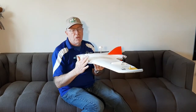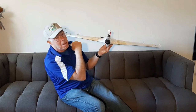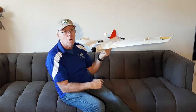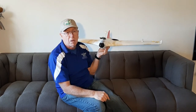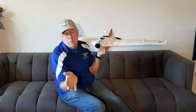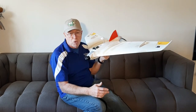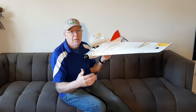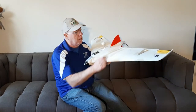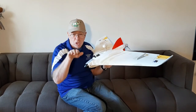It's very interesting to note that with this airplane, the mild dihedral — actually almost no dihedral at all, if not slightly negative — still causes the airplane to roll with yaw command, just like the old trainer airplanes we used to fly as kids. Those only had rudder and elevator with generous dihedral; when you used the rudder the wing would yaw and one wing would have a little more lift, and it would turn much like an aileron airplane but only with the rudder. When I flew this airplane for the first time with the drag rudders, that did happen — I did get some roll from the yaw, which was expected. You can always take it out with conventional aileron control on the elevons if you don't want the airplane to roll while yawing.